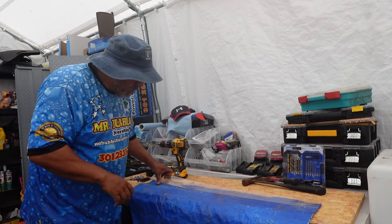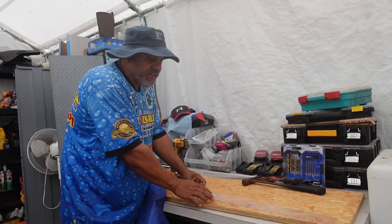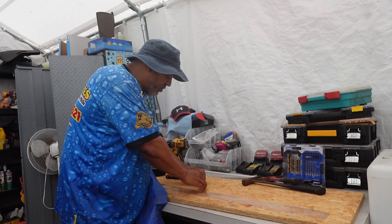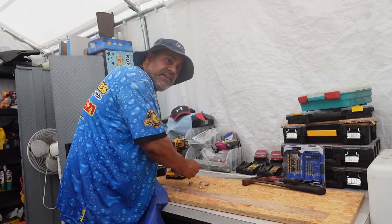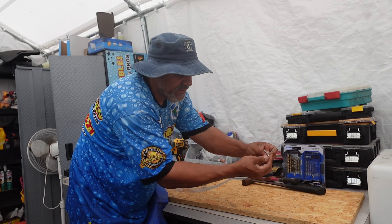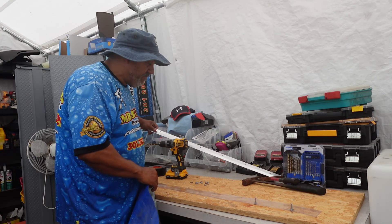So now here you go — the plastic is drilled, the aluminum is drilled, and the tarp is drilled. What you're going to do is put the plastic piece at the very bottom on your table and take your five bolts — remember these are quarter inch, one inch long. You're going to put them through your plastic piece. Basically what you're creating here is a sandwich — think of a sandwich in three parts. The bottom bun is this plastic piece, you're going to put your bolt right through it. The meat part is the tarp. The top bun is going to be your aluminum part.